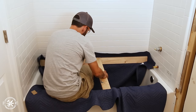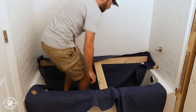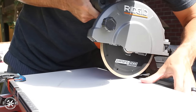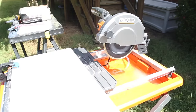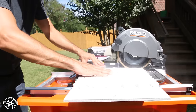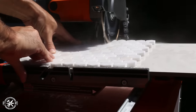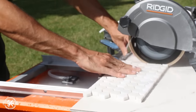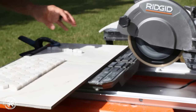As a final step to help the wall set up firmly, I used some 2x4s wedged against the tub to hold the bottom tight and left it all to set up for 24 hours. The wall system has a nice subway tile look, but what really sets it apart is the custom accent channel to add your own style. We went with a hexagon mosaic tile for this feature. I set up my tile saw and used an extra floor tile clamped to the table as a zero clearance cutting surface. Cutting a shallow line in the tile lets you see exactly where the cut will be and gives you support to cut small tiles, which have a tendency to blow out and chip. I cut down the tiles to the right height of the accent opening and then cut the pieces to size for the beginning and ends of the channel.